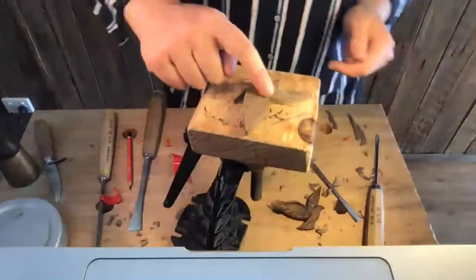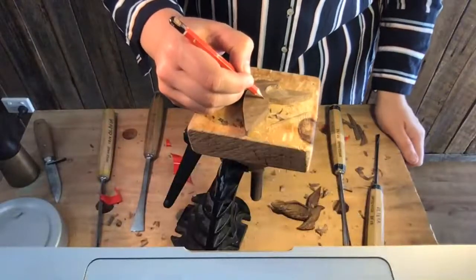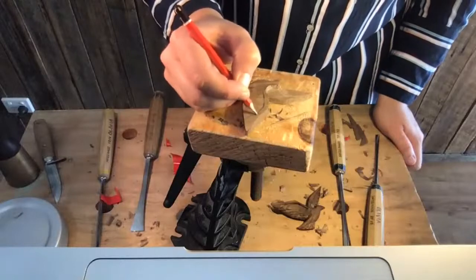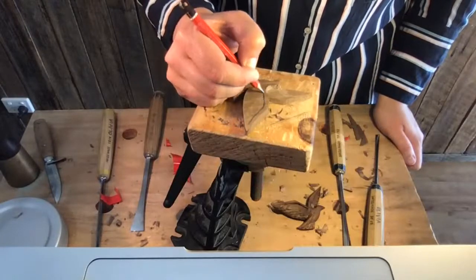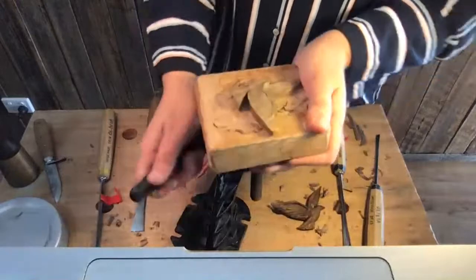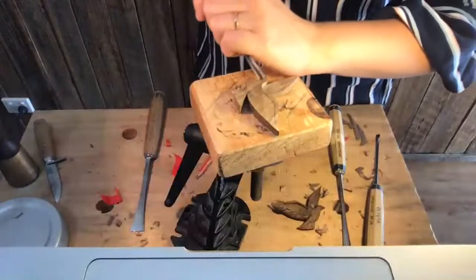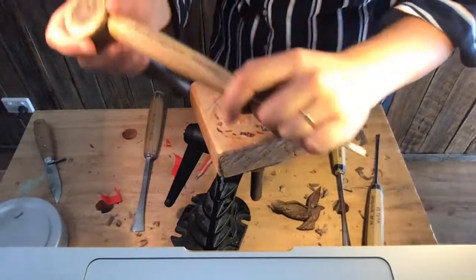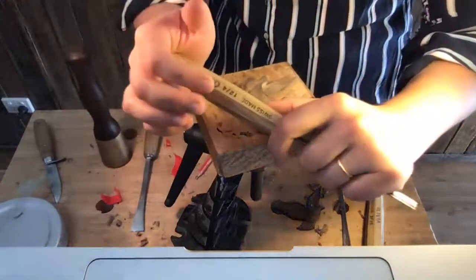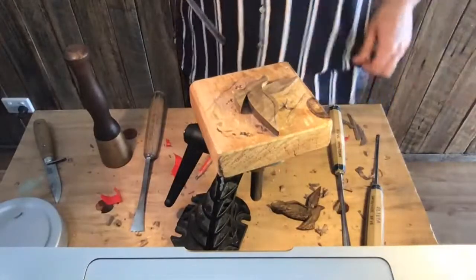Next I want to add some shape definition to this big wing. Just going to draw — looking at my template for reference. This is the high point of my entire carving. Now when you're doing little carvings, it's often strange but you'll have more control using a mallet rather than hand pressure — you lose a bit of consistency. So I'm resting on the ball of my hand and just tapping along, twisting my whole body around to follow that curve.